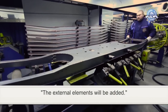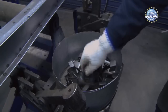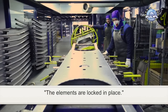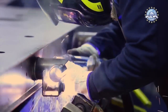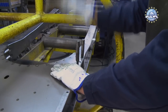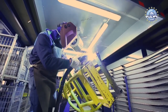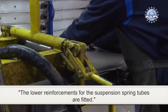The external elements will be added: the shock absorber and spring tube supports, the rear towing loops, the rear exhaust support, and the front towing loops. The elements are locked in place, welded into place, then released and the welding is finished. The chassis is then moved to the rotating welding table, where the front and rear axle fixations are locked and welded into place.